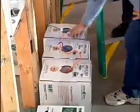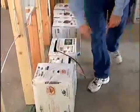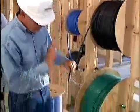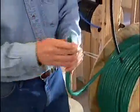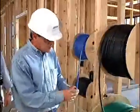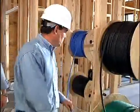We're going to use a variety of Genesis cable on the job. We've got 3 different colors of Cat5 for different applications, regular quad RG6, audio cable, and 2 and 4 conductor security cable. We've got this Siamese quad RG6, handy on our roof locations. And where we need 2 Cat5 and 2 RG6 at the same outlet, we're going to pull this bundle cable. It's got all 4 inside a common jacket. And we're even going to use the Siamese Cat5 and RG6. This is real handy at places like camera locations.